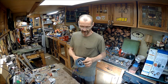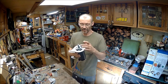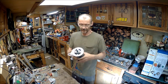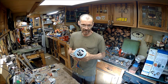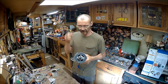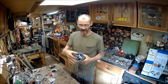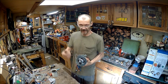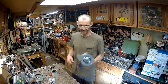I'll have to overcome the threading issue. I may have to make something and thread it to put on here - it's a little bigger than this shaft. Then somehow mount this up to the lathe, turn it on, and lathe that part down to make it the same size as this shaft. That way I have a full shaft and can put the pulley and everything on it. I don't know yet - we'll find out.